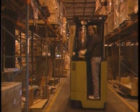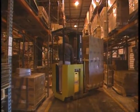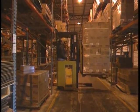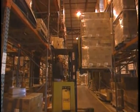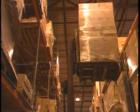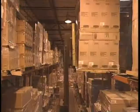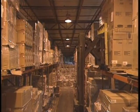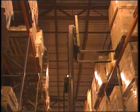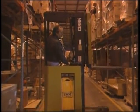As the operator reaches the proper location, he stops and positions the truck square with the racks while the load is still down. Note that the operator moves slowly to position the load — abrupt movements can cause product to fall off. By positioning his truck before raising the load, the operator avoids turning the truck while it is less stable because the load is raised. Once the truck is stopped after positioning, the operator raises the load. Never elevate or lower forks while moving, turning, or maneuvering the truck into position. Note that the operator moves the truck in as far as possible before using the reach mechanism to place the pallet fully onto the rack. Minimizing how far the reach mechanism must extend keeps the truck as stable as possible. The final maneuver is retracting the forks and dropping them to within four inches of the ground before turning and moving down the aisle.